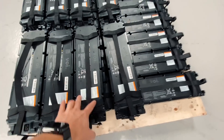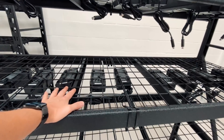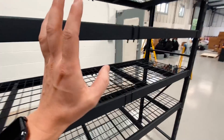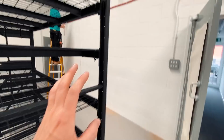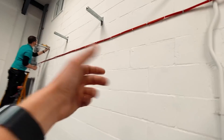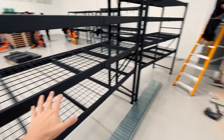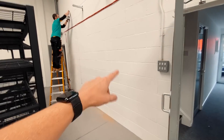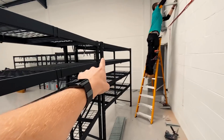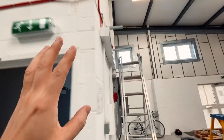These are the batteries which are going to be charged up by these charging stations. Each of these charging stations we're going to be installing a three phase 16 amp commando socket. That's going to be mounted high up on the wall so they can plug in and basically this whole rack will come live. For the moment we're just installing three, but we're preparing everything so that we can install more in the future.